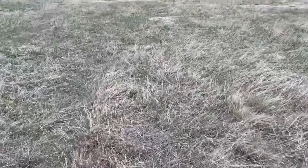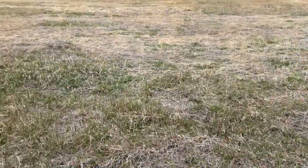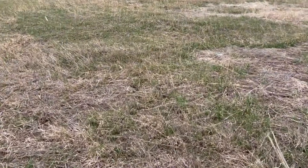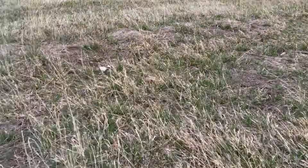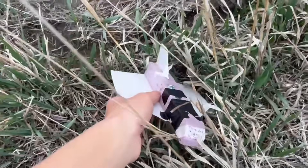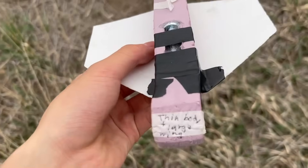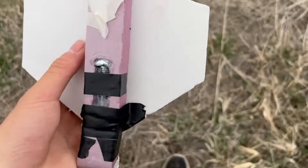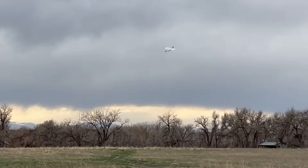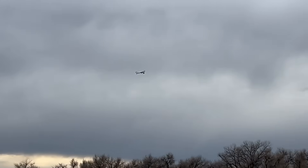I had no idea where the glider landed — it's really hard to find in such tall grass. After finding it, I think it might have been a little too nose-heavy because of all the tape, but I also needed to separate the stabilizer. After moving the CG a little further back and giving the wing some more reflex, I got a much better flight.